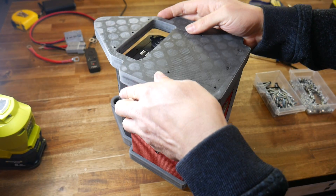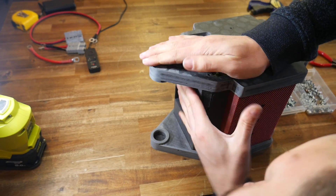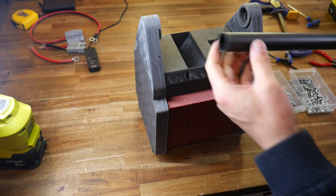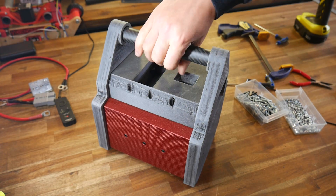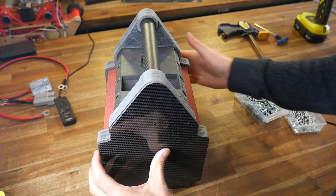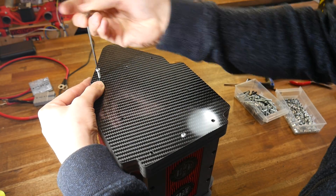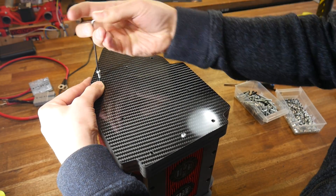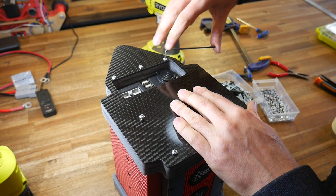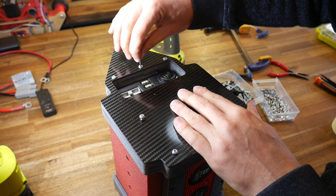To finish off, we place the two end caps into position. These should be a snug fit because they stop any of the other parts from moving. I did a final double-check of the measurement for the carbon fibre tube, trimmed it to length, and tested that it was secure. The final visual feature is the carbon fibre end plates — these simply rest on top before M4 by 30mm bolts go through to attach to the captive nuts. Repeat for the other side and the assembly is complete, which was surprisingly fast, especially considering how long it took to design and print the parts.